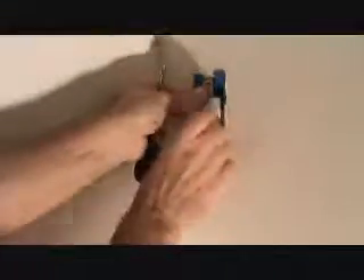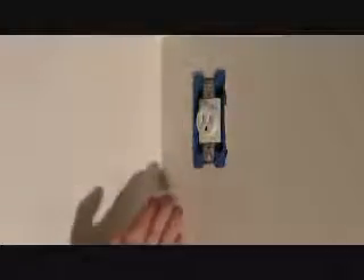That's looking good. I haven't tightened this up all the way just yet — I've got it in the groove. Before I tighten it all the way, you can see there's a little bit of slop in here because where the screw is that hole is open a little bit. If this box was slightly off, you could straighten it up by pushing the top over to the left and the bottom over to the right. But I don't really need to do that because this box looks pretty straight, so I'm gonna have just a little reveal on both sides of that notch. I'm gonna screw that in to kind of hold that — make that snug. Same thing down here, just gonna hold on to the plug, make sure it stays right there. I got just a slight gap on both sides and that looks nice and straight.